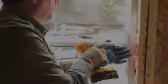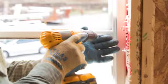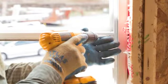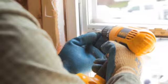To remove the keeper rail, begin by using either a drill driver with a number two Phillips head bit, or a number two hand driver, to remove the two screws holding the keeper rail in place. Place these screws with the sash, glazing bead, and top glass, as you will need to reuse them.